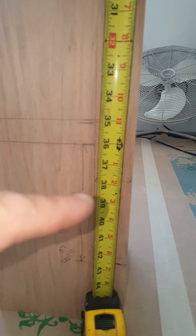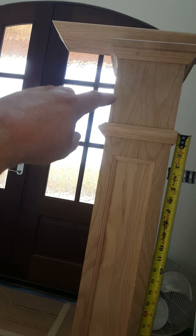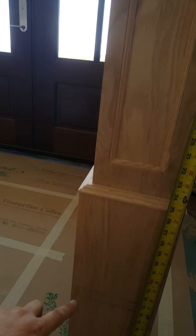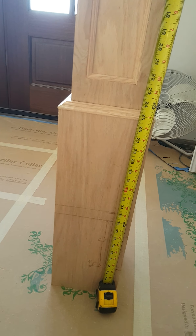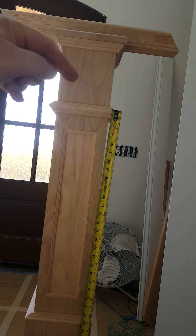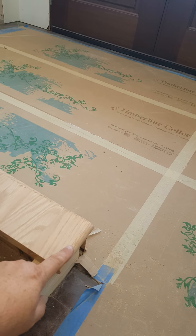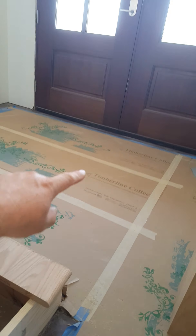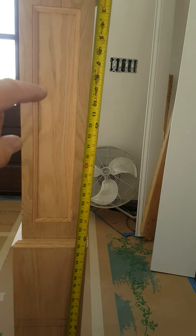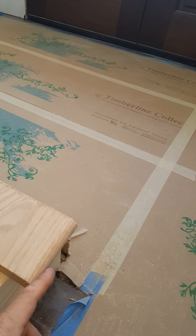You may ask why I'm doing the 35 inches out here and not back here. Simply measuring from here down 35 inches because the post would be too short if I cut it that way. I have to take into account the handrail projecting through and where the handrail is in relation to the step, because I want that 35 inches from the nose of the step up to the top of the handrail — that's the way the code measures it.